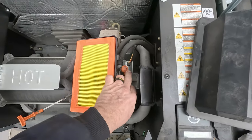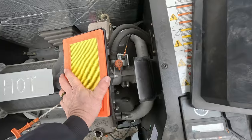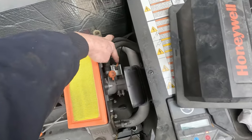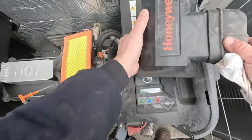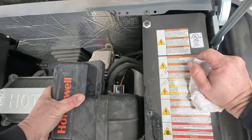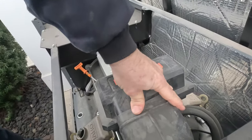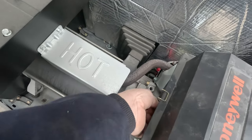This is also where, when you're first starting it up, you have natural gas and LP. If you have a problem and it never worked right, double-check to make sure the thing is actually set for the type of gas you're on. This one's on propane, so it's already been switched — you can see the arrow points to LP. There's your servo control, which is what actually controls the fuel-air mixture, something automatically done by the little computer. So we hook that back and make sure we get it back in there.